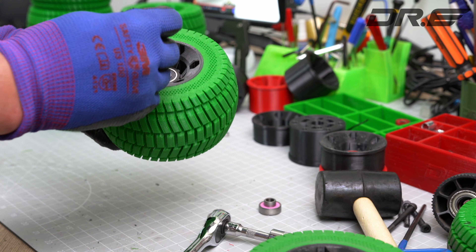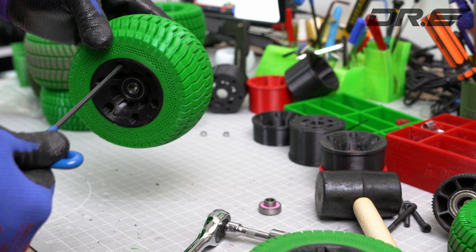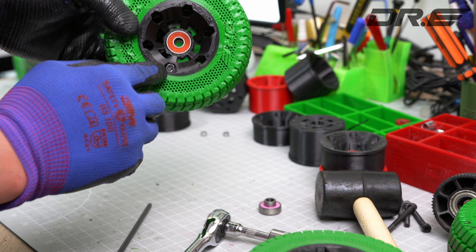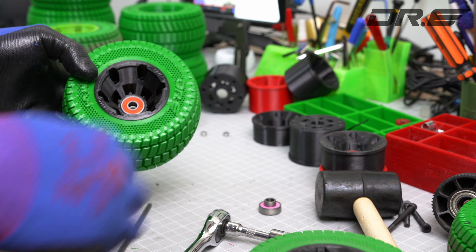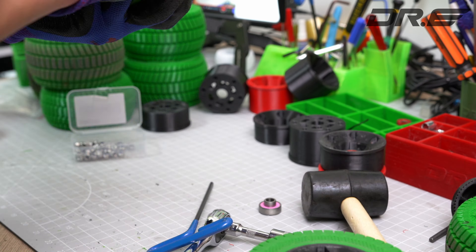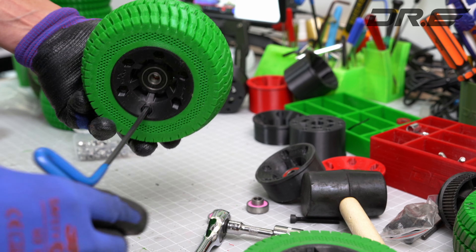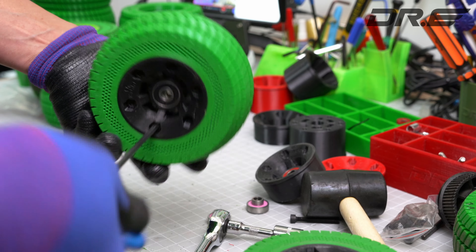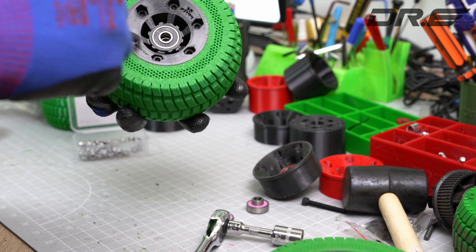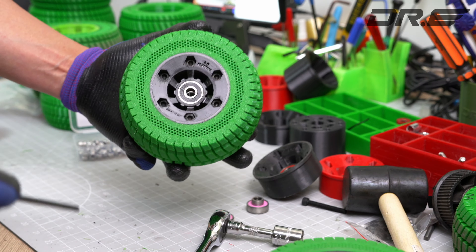Go ahead and stick the screw on the other side — it should fit snug like that. Use your allen wrench and go slow about it — it should tighten right up. I would actually recommend the 50mm screw; 45mm is just barely in there, but it's fine. Do that for all six holes. Make sure the nut is sitting down when you're screwing in. I recommend doing it manually rather than with power tools, because sometimes with power tools you can strip it. Tighten alternately in a diagonal pattern — you don't have to over-tighten.